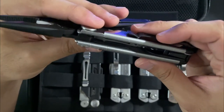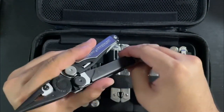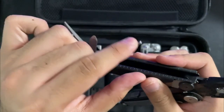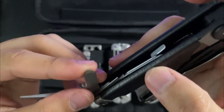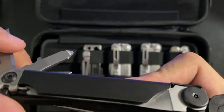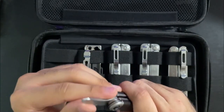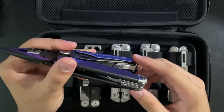The tools on the silver handle side have all black tools. I always wanted an all-in-one Wave because I feel like the micro driver should be replaced. So I have the scissors, I got a rebar awl, and then with the flathead I made it into a combo driver — a dedicated implement that can do flat heads and number two Phillips. I tapered it and put the edge down a little so it's also a little easier to pry stuff with. This was my second attempt at the combo driver tool.